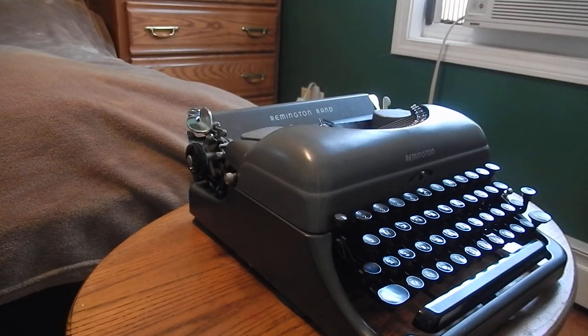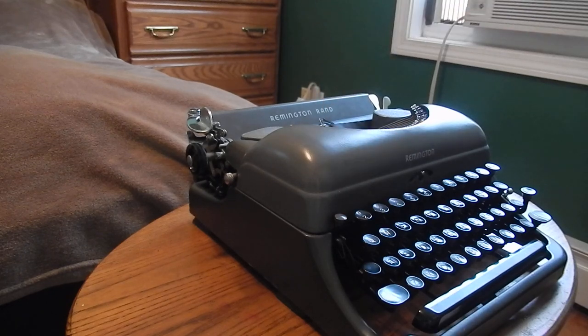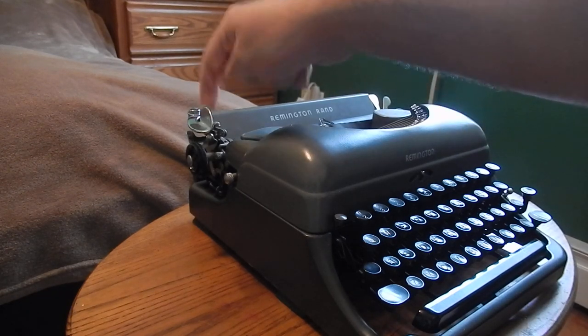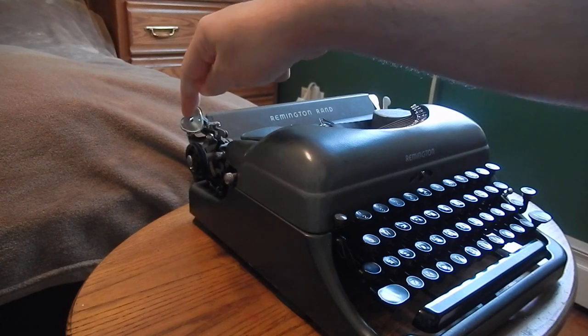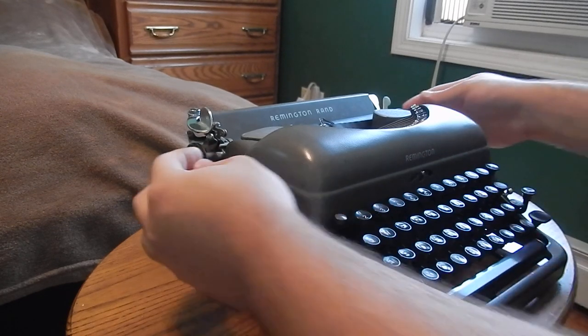The platen is in good shape and overall it's in nice shape — it works very well. The only cleaning I had to do was cleaning out some eraser shavings that were on the ribbon transport system, on the gears and things down in there. Other than that it was in good shape; I didn't even have to do any cleaning. My father and I did have to replace the spring for the return lever, which was broken — the original one was still in there but broken — so we got another spring and cut it down to size. Now it works well.